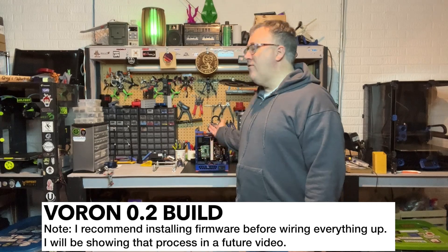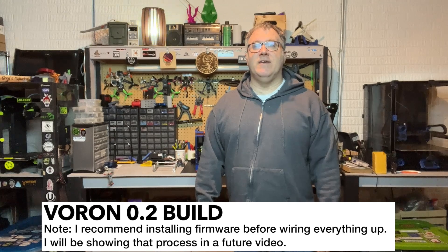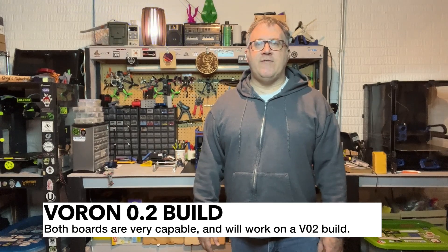The other reason this might be a little confusing is because the footage you're going to see is for the Mellowfly SHT36V2. I'm also going to show you what I ended up ultimately going with, which is the BTT EBB36. Basically the CAN bus board I had originally just had some firmware issues and I didn't have a spare, so I ended up going the BTT route. Those boards are very similar — the only real difference is the connectors and the firmware you're going to flash to them.